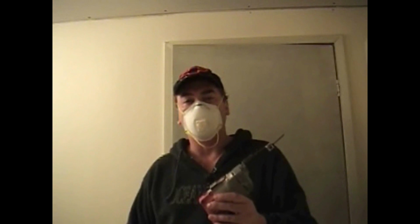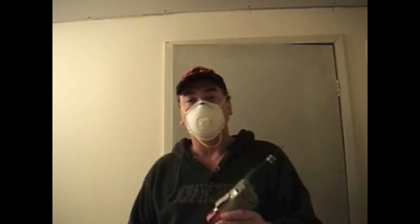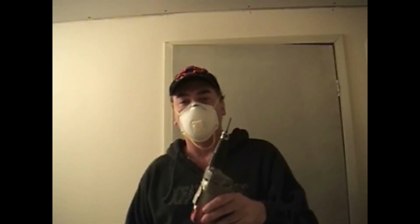So what we've done at this point is we've hung this sheet of sheetrock on the lid by screwing off the perimeter of the board. Now it's time to screw off the field. We'll be using a screw gun and a 2-inch screw. As you remember, before we started hanging the sheetrock, we made marks on the wall as reference points, so when we installed our sheetrock, we knew exactly where our ceiling trusses were.